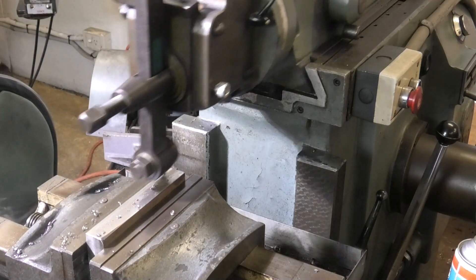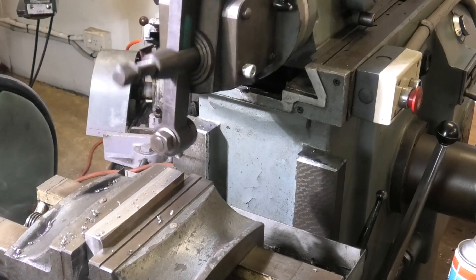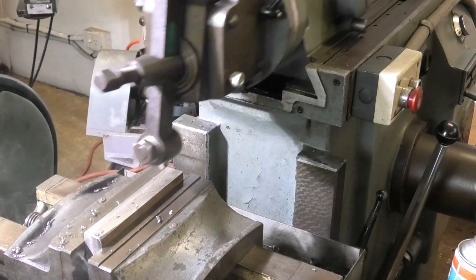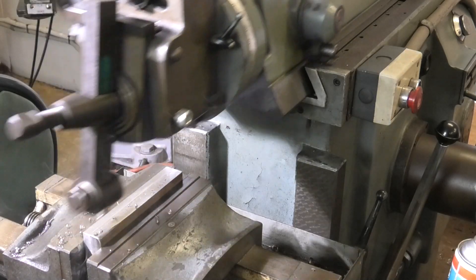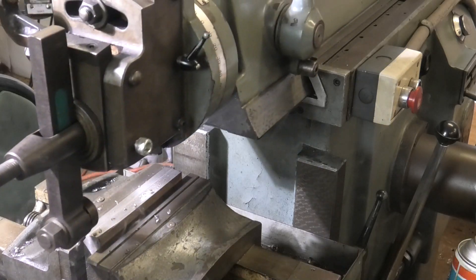Now this is what a shaper is really good for — something that's much longer than it is wide. You could have three or four clips of 25 by 12 up on the edge in there. Load the device up, walk away, and the job's done without having to attend. See the little curly swarf coming off.